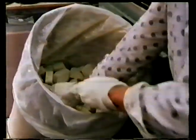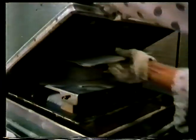In this case, the polymer comes in a fine powder, which has been pressed into a slug called a preform, a process which reduces contamination. Because each preform is the same weight, an identical amount of polymer is used every time.